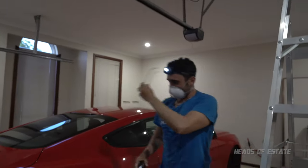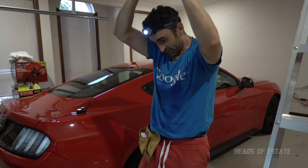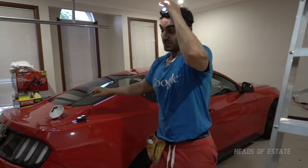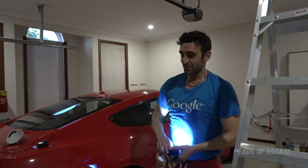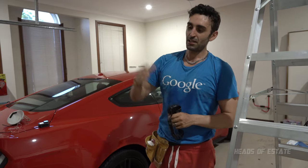All right, so that was a worthwhile exercise. Even though I couldn't get to the gutter of the garage, it was still good because I saw that the gutter was connected to the attic, so it means if I did use the fish tape, I should be able to feed the wire through. What I was concerned about is if there were some obstacles in the way that would stop me, but it looks like there aren't, just bits of wood. So we'll go back outside and we'll drill a pilot hole now and see if we can fish some wire through.